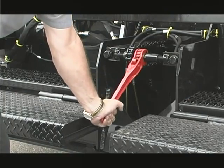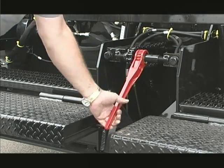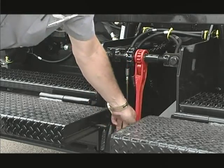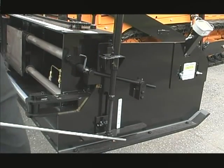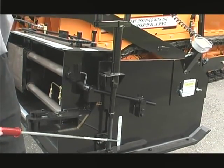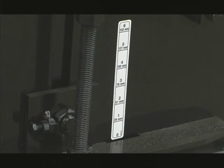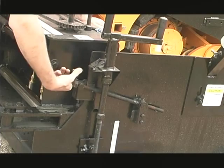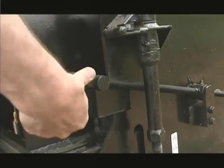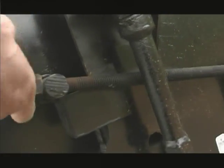Use the crown adjuster handle, pushing down for crown and up for valley. On the first pass, unlock the depth screws and lower end gates to approximately one quarter inch of the desired depth. This should provide a nice square edge on the asphalt. The scale located on each end gate will show the proper depth setting. Tilt adjusters on the end gate should be set so that the front of the end gate tilts slightly downward when the screed is lifted. This will allow the end gate to set itself to grade.